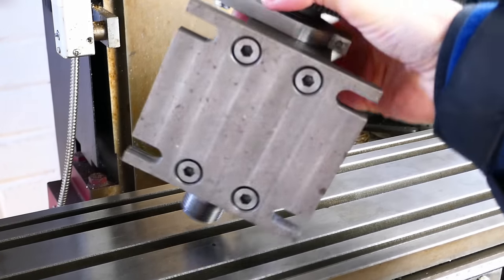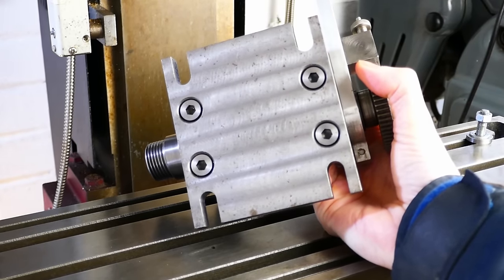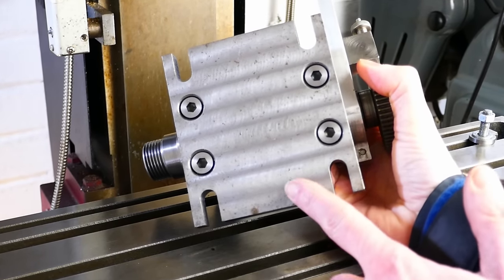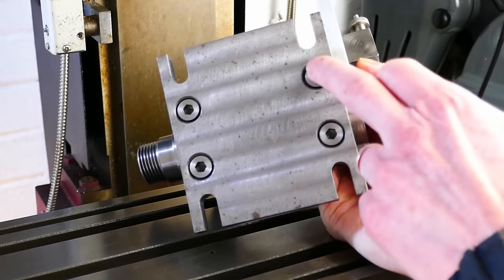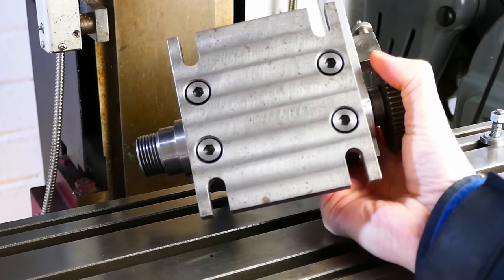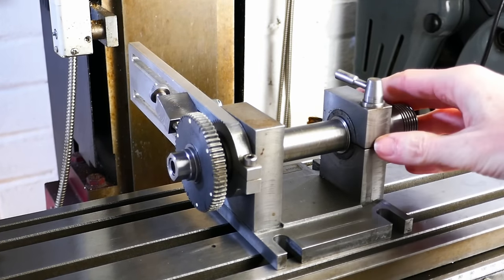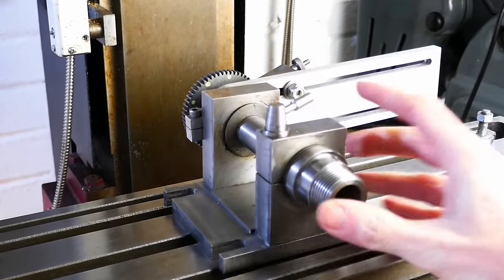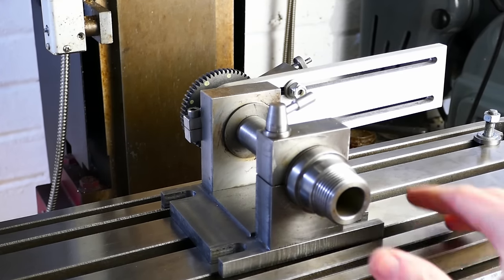This is the underneath of the device. I've machined it flat, as can be seen by the marks from the milling cutter. The base is fitted to the uprights with four countersunk screws. The slots in the base are for bolting the device down to the mill table. They are spaced so that I can align the dividing head with the spindle either parallel or perpendicular to the x-axis, just in case there's a reason to work in that position, which is quite unusual but can happen.